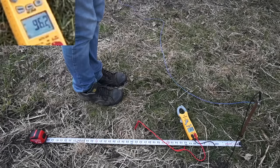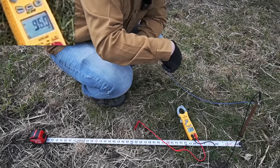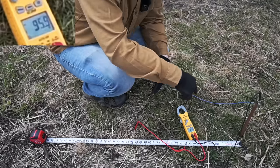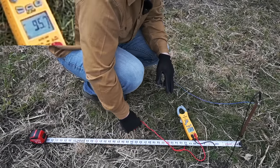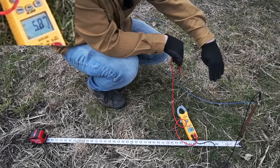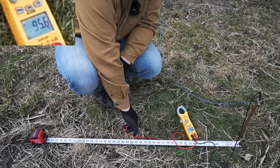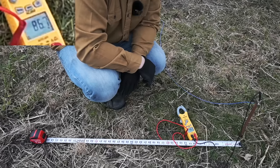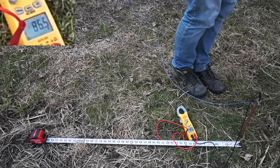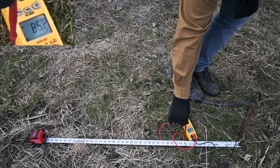I'm going to show that to you right now. At two feet from the pole, we are at 95.7 volts. So even though this 120 volts is being grounded — hooked directly to ground — we still have a difference in potential of close to 100 volts, 95 volts at two feet. Now at one foot away, still 86 volts. So if I was barefoot and standing right here next to this ground rod and touched that thing, that would kill me — shock straight through the heart. Obviously the closer we get, the less difference there's going to be. At six inches, we are at 75 volts. At three inches, 67 volts.